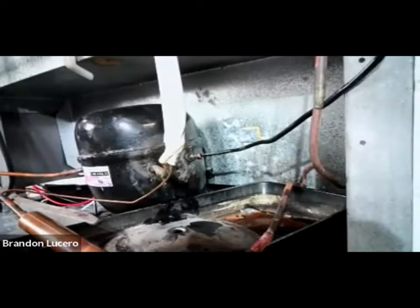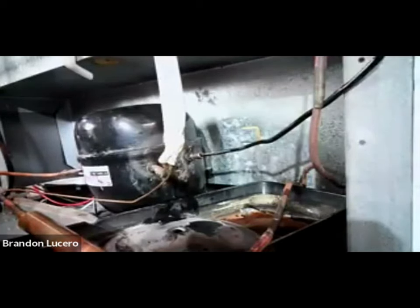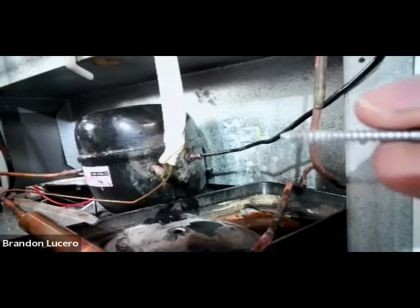It doesn't matter what material the screw is, but you don't want a real cheap screw. Don't use anything that's got paint on it. You want one of these silver-type steel screws - steel can accept the heat and the solder will stick to it. You can see the solder that's on there - he pulled solder out and we did it with more than one screw.